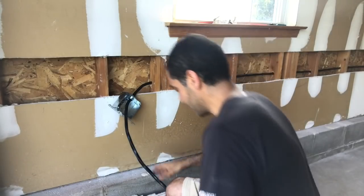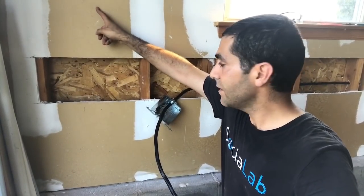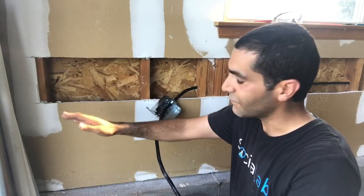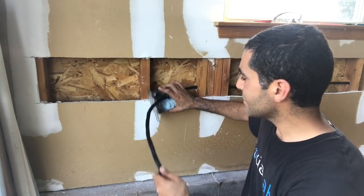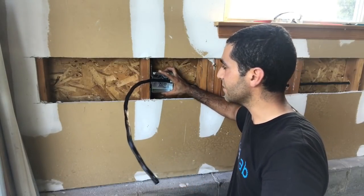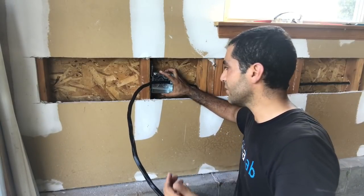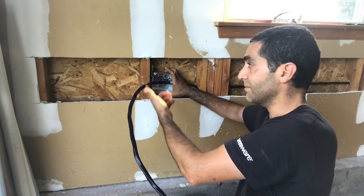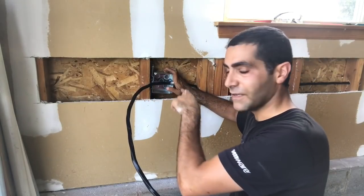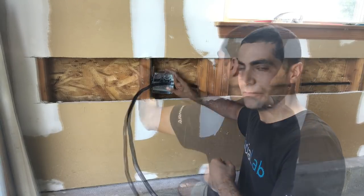I moved along a little bit and changed my mind. Initially I said I was going to put the box up high on this side, but judging by the closeness of the wall and everything else, it makes a little more sense to have the mobile connector sit a little lower. Also, in the event that I do decide to put in the wall connector in the future, I could still use this as a junction box and run a wire up a little higher where the wall connector would make sense. So we're just going to proceed with the box in this location.